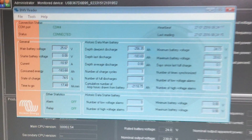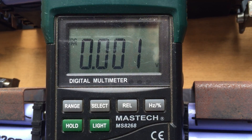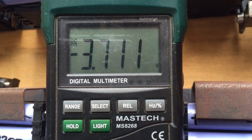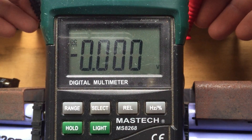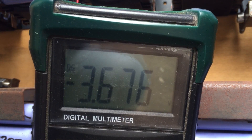We've got twenty-five point six seven volts overall. On someone's suggestion I've set the range this time, and I'm going to do it in the same order as last time for consistent values. First one — bottom left, bottom right — 3.7, 3.7, 3.6, 3.7, 3.6. So that first pack is pretty close.